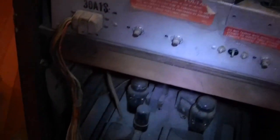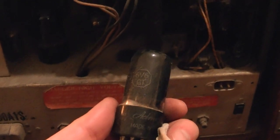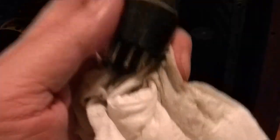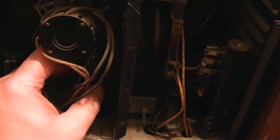I think I will still proceed with my plans to try carefully firing this set up. I've been pulling a few tubes out and cleaning them so I can see what's going on when I power it up. So far all but one has been an Admiral-branded tube, including the damper tube, the horizontal output tube, the 5Y3 rectifier, the 6V6 vertical output tube, and the 6K6 vertical oscillator tube. The only one that hasn't been Admiral-branded is the big 5U4 rectifier. And the CRT is an RCA — but the original CRT may have been an RCA, as Admiral never made their own CRTs; they just rebranded them.